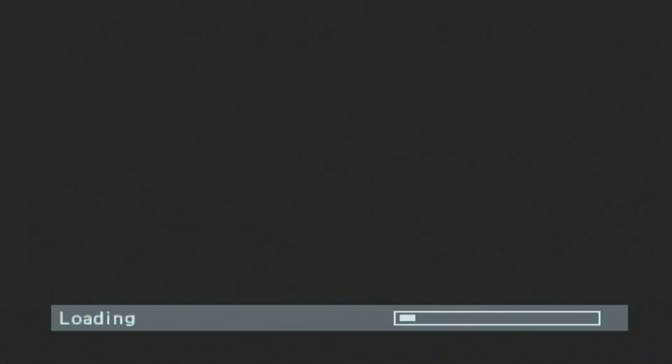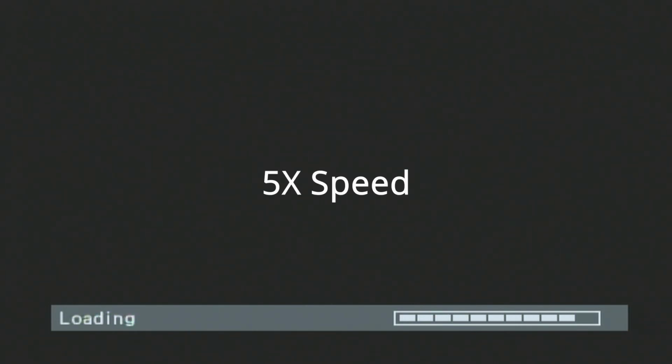I do have a VHS tape in it right now. I'm going to go ahead and put a blank DVD-R in it, let it load it. And I'm going to make sure it's on the 3-hour mode because my VHS tape is a compilation of SP and EP recordings, and it is 2 hours and 55 minutes long. And it loaded it up. It knows it's a -R, so I'm going to hit the record mode, and it tells me I'm in the LP 3-hour mode.